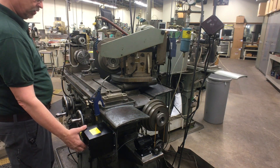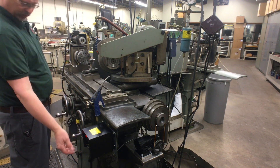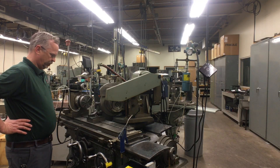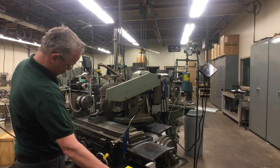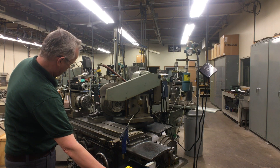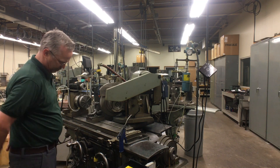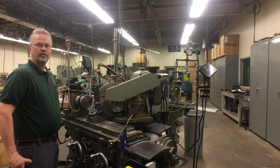This used to have belts off the ceiling, but now it doesn't. With the table drive, when I dress and when I grind, I can go back and forth. One of the things about grinding is you'd like to have a consistent dressing speed and a consistent grinding speed. I'll feed in a little bit and maybe slow it down, because we're going to want a really smooth dress on this wheel to get the absolute best grind we can. Because if I'm going to beat a Studer grinder with this grinder, I'm going to need it really smooth and really good.